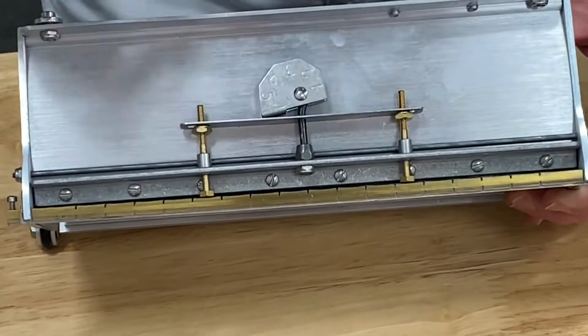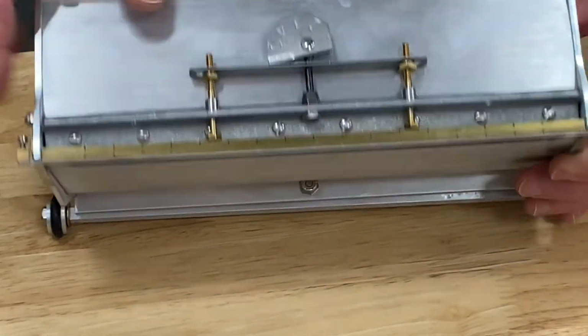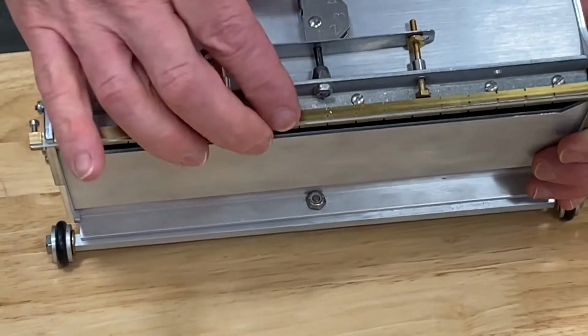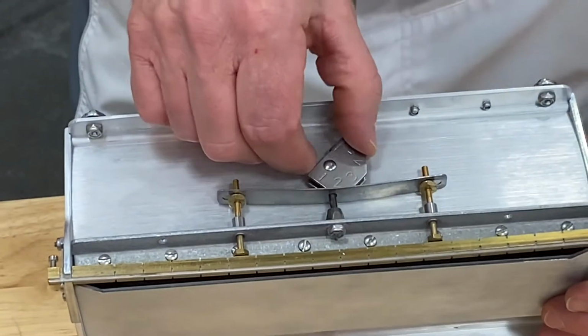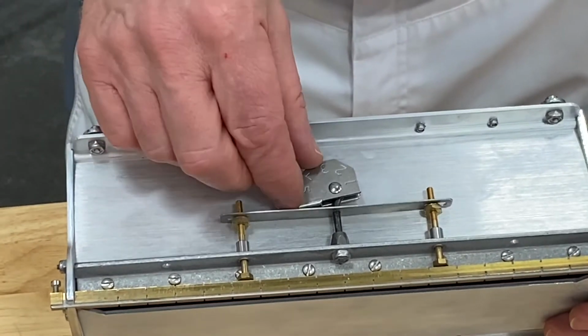Lower number, or 0 or no pressure, there's the maximum amount of material that can be left on the joint. The brass blade holder is flat, it should be flat, and as you push on it, it crowns out, so it leaves less material. Now on the higher boxes, like the 12-inch, it would be on like 3, perhaps. On the lower boxes, 7 or 10, it would be on 1 or 0, depending on the joint.